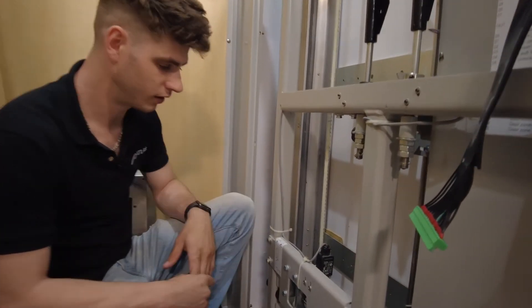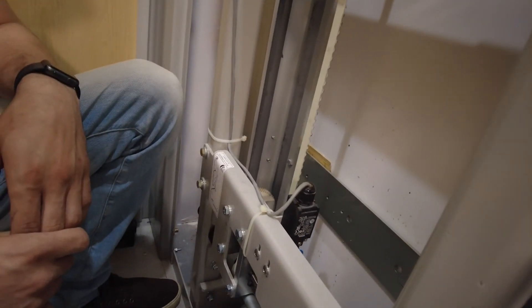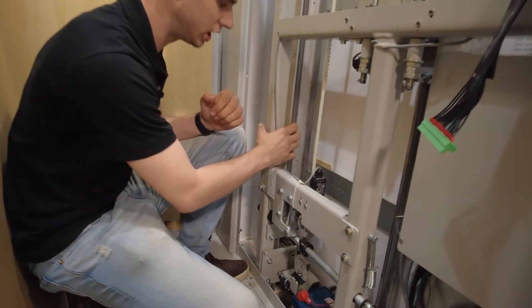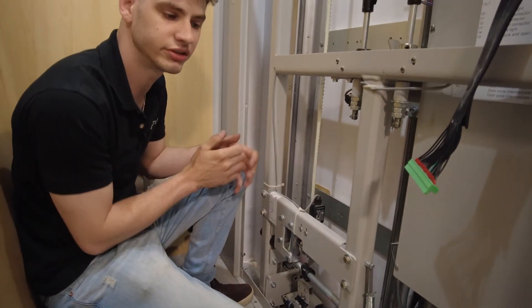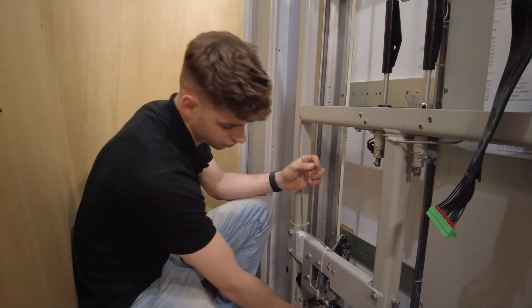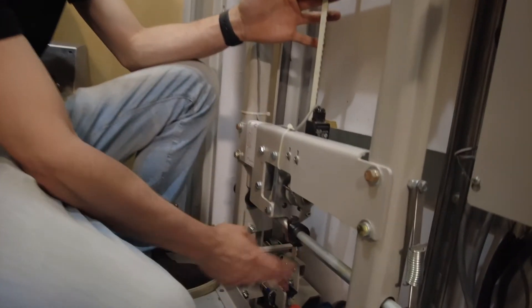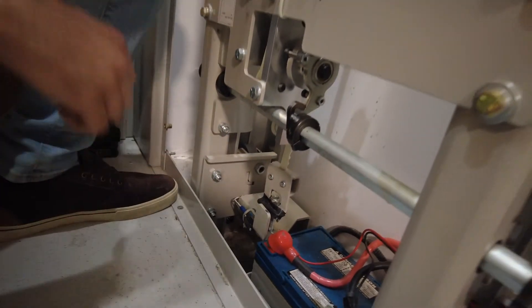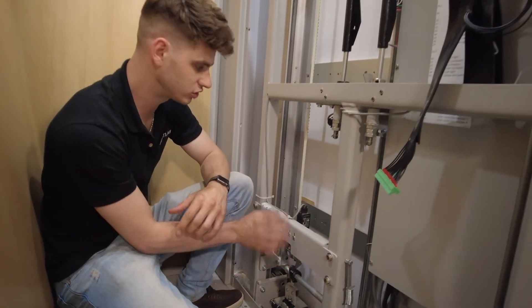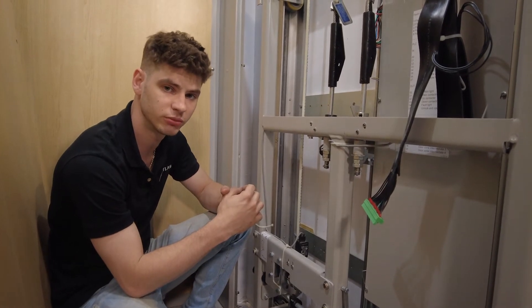This is our unit's speed governor. It maintains the correct speed of the elevator. If the elevator were to free-fall or descend faster than it should, the speed governor will trip and engage the bar to engage the brakes into the rails, completely locking the unit in place. It also goes through a strap attached to a switch, so even if the cable were to break, the switch will fall and cut off power. The speed governor travels up and down with the cab, turning throughout travel — if it speeds up, it opens and engages the brakes.